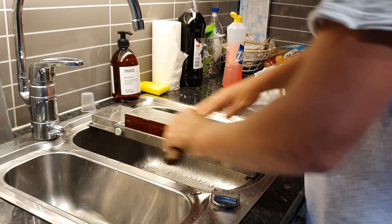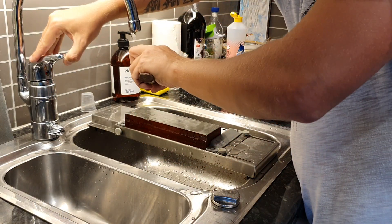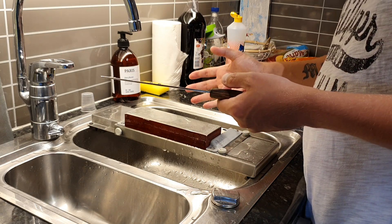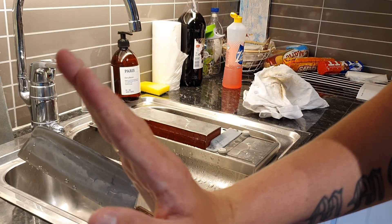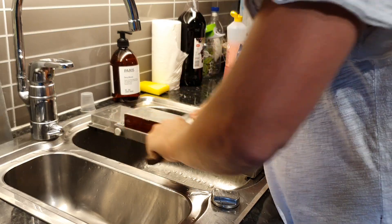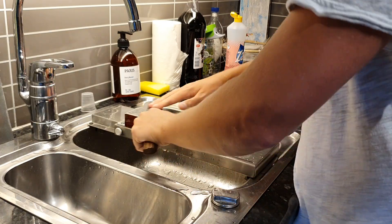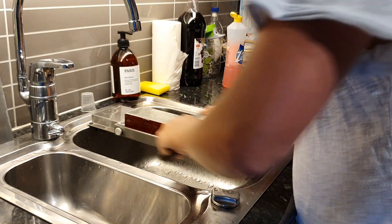This and the other one from Patrick Kallvik — the K-tip in ABL — are my highest-performing blades by far. I can't use any pressure here; it's just the weight of the knife, maybe 500 grams. If I use more weight I will bend the edge so it won't be straight — I'll weaken the metal very quickly. You can't use any pressure or you'll just deform and crush the edge. This is a fantastic stone on this steel; I don't like it on softer steel as it's a bit scratchy, but on this it comes out fantastic.